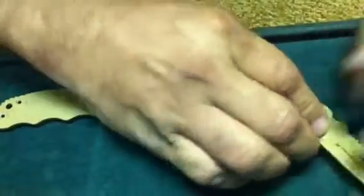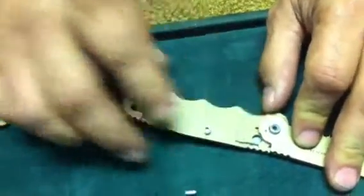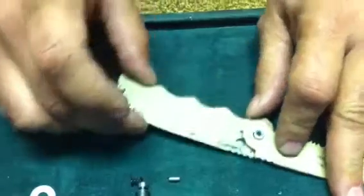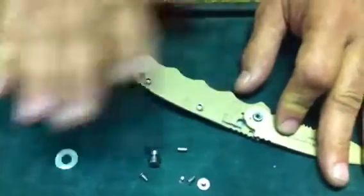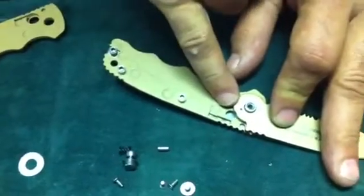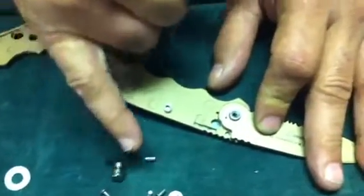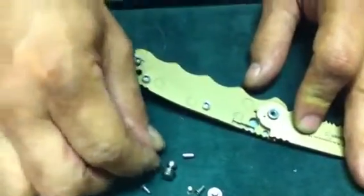What I always do is I work and put pressure on the scale and the knife blade, as you can see. I let a little pressure off and the spring is going to wrap that knife. So I always put pressure on it when I'm assembling. If you notice, the stop pin is not in here. The spring and button is not in here. It's hard to put the firing button in with the stop pin in, so that's the last thing that goes in.